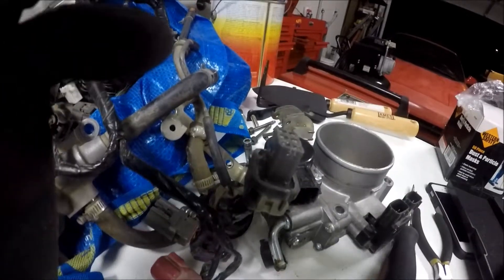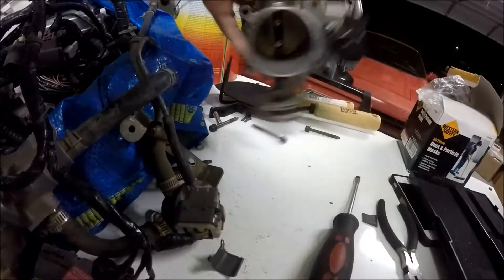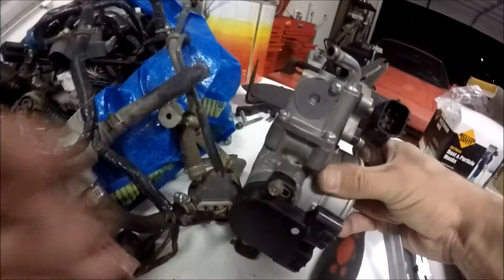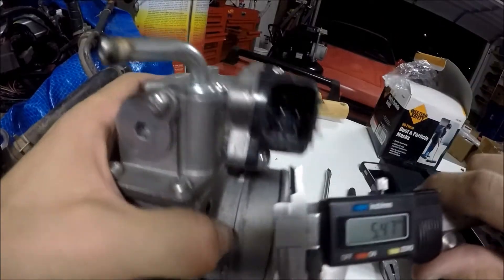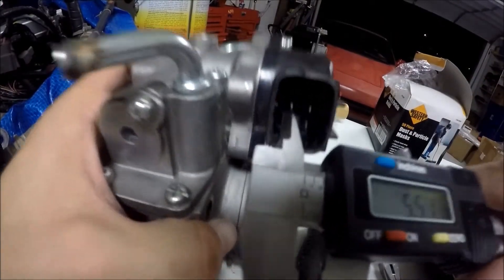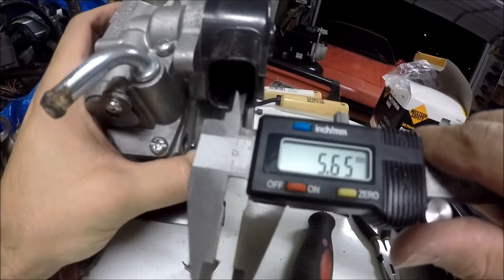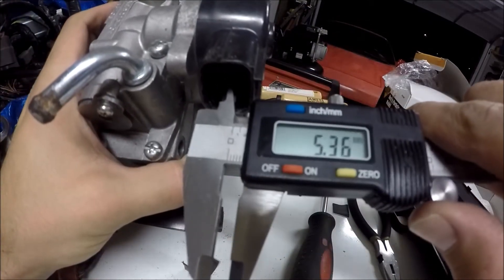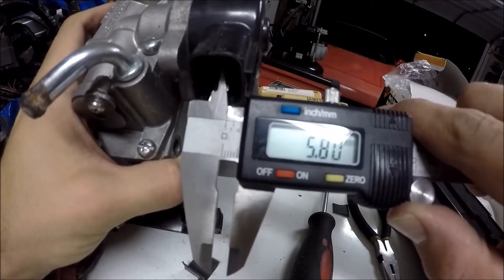So that's it — have fun! And lastly, if you have a set of calipers, my ideal distance for this particular connector is about five and a quarter millimeters between each pin. This one's about five and a half, five point eight, and five point seven three.